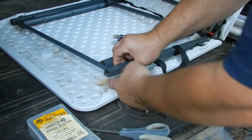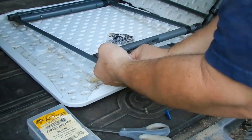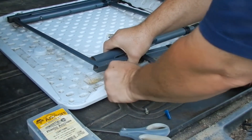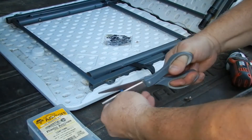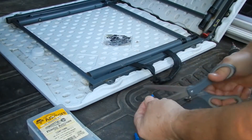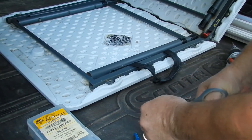What you want to do is lift this up. That's the broken plastic right there that this used to screw into. Put this in there and see how deep it goes — there's about a quarter inch sticking up. So you want to take a pair of scissors and cut that off. Same thing with the other one, just on the bottom. These are the drywall anchors.